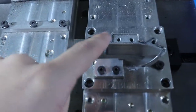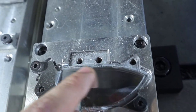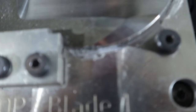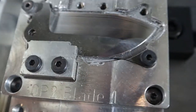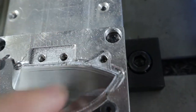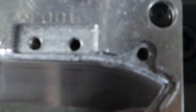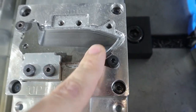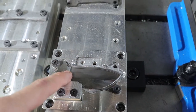I had a little interruption so I didn't film the intermittent part between the parallel. Here is the final steep and shallow — absolutely beautiful compared to what I had last time. The bevel is way, way better than any other time. See this line? It continues and then stops right at the corner — so it's missing just the edge. That's something I need to fix, but other than that we didn't break the edge, which is super awesome. I need to come in and contour just the edge; there's a bump here from stock I left when I took the tab off. But I'm pretty excited because this is the first one that looks halfway decent off the machine.